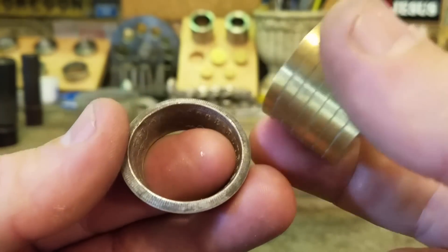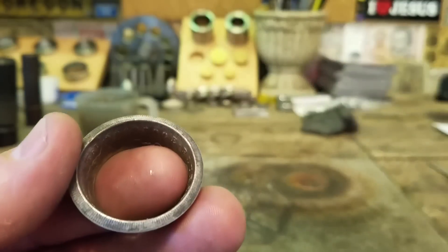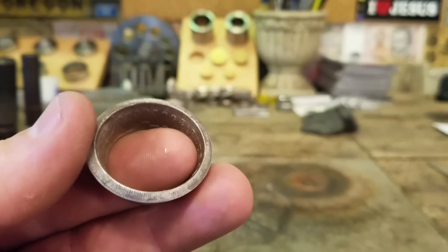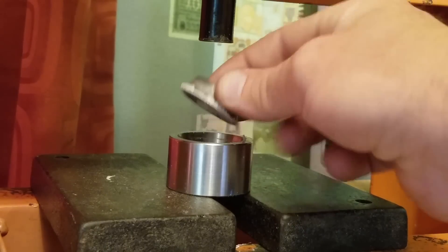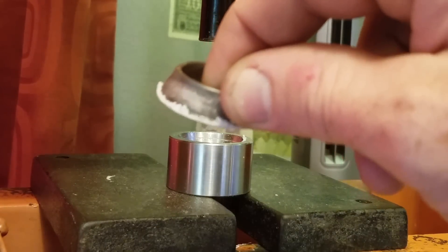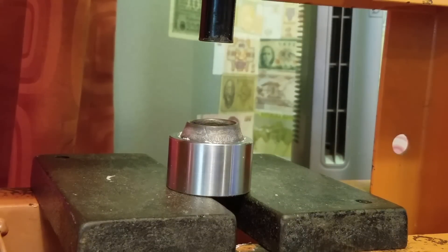Actually, what I've been doing is just foregoing the first plunger and reducing this down to just a little bit larger than the second plunger, because I don't usually use the first one. So here we are at the six ton press. I have the reeded edge down in my die and I have a little Pepe lube on there to make sure it goes down smoothly, and we're going to start reducing this thing.